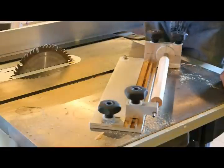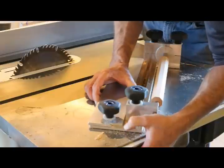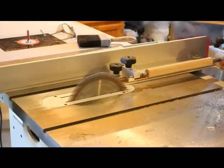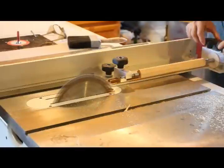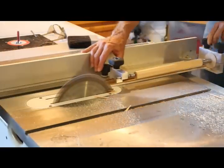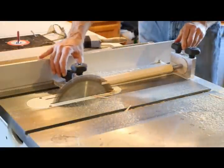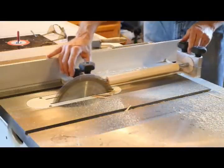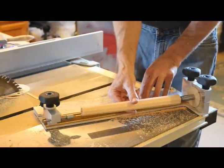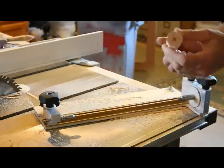It also has the capability, like in the round, of cutting a taper. And all you do is just open up the taper attachment. It's calibrated here. I'll open it up maybe for 30 seconds, and I'll make a tapered cut now. So you can see it cuts a taper on there, very nice, very accurate, very straight. You can see the cross section is a perfect octagon.